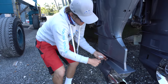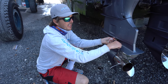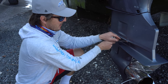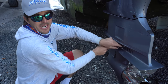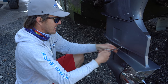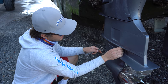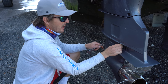We're gonna drop these lower units, take a couple bolts off on each side, a couple of nuts off, and he's gonna bring some lower unit stands so we can stand them up real easy and change out those impellers. A lot of people ask why — they're running great, there's 1,080 hours on them. But I can sell them. I've been working with the Yamaha for over five years and they give me a decent price, so it just makes sense to do it that way for the business.